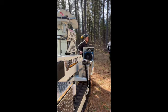You have 2 adjuster bolts up here. You're going to break this inside nut loose, excuse me. Walk you back towards the machine. You're going to tighten these nuts down. That's simply going to pull this engine, pull that clutch, and tighten that belt. Real simple process. Should take you 10-15 minutes once you know what you're doing.